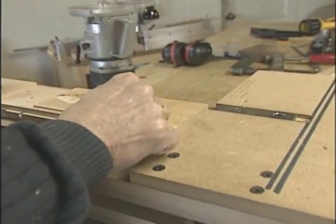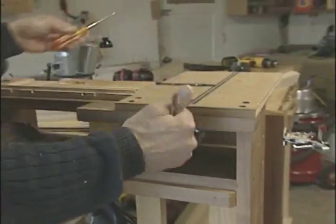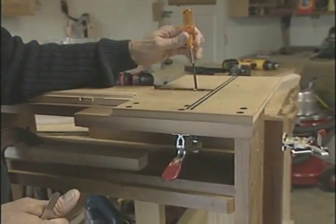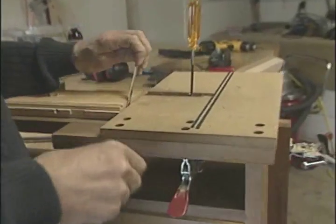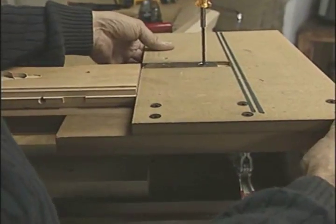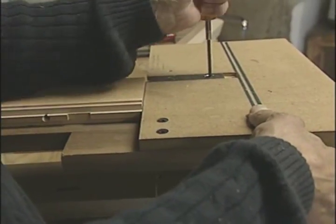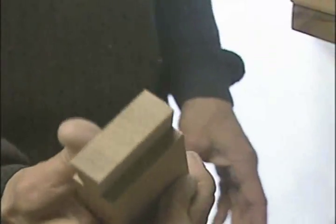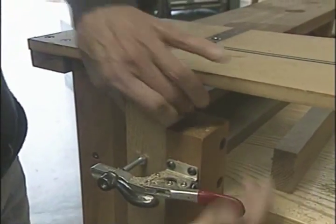Instead of a C-clamp, my template is held by a steel bar and a toggle clamp. I use a feeler gauge as my spacer between a reference stick and the template to make the adjustment predictable. If it turns out to be too much or too little, I can use the next size feeler to correct on succeeding attempts. Now, we'll cut a tenon on the opposite end of the sample with the new settings.